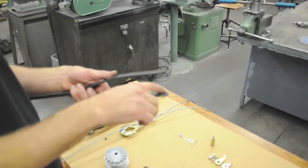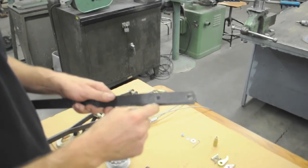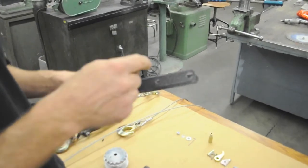Okay, especially after powder coating, you'll have paint in the holes and you're going to need to do that again. You will probably need to drill out the paint from all the rest of the holes. On the tables we'll have a 5/16 drill that you can re-drill the holes.